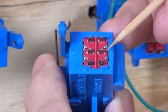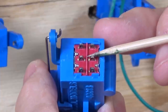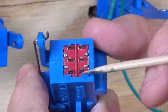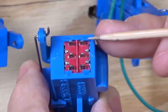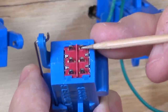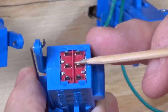What we're going to do is attach the green wire already connected to the frogs when we installed the ElectroFrog turnouts a few videos ago. That wire will then be connected either to the red or to the black wires through these contacts. So if we attach the red wire here and the black one here, the switch internally will make a connection from the red to the green or from the black to the green depending on which way it's thrown. We need to figure out which wire gets attached to which set of poles.